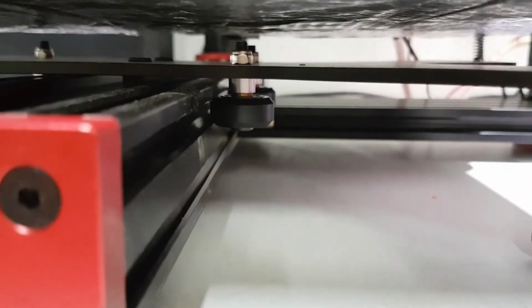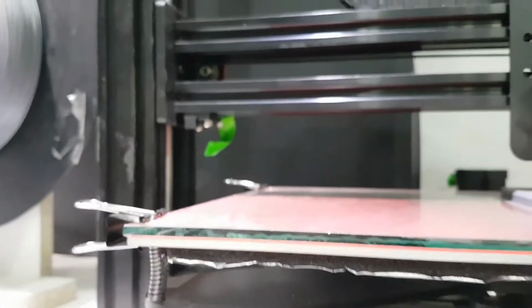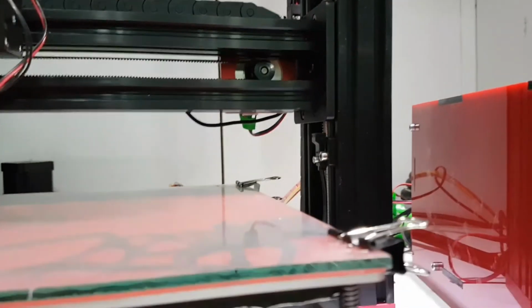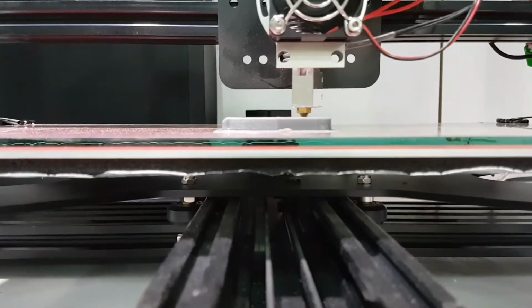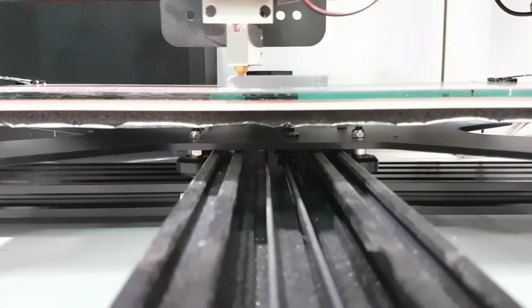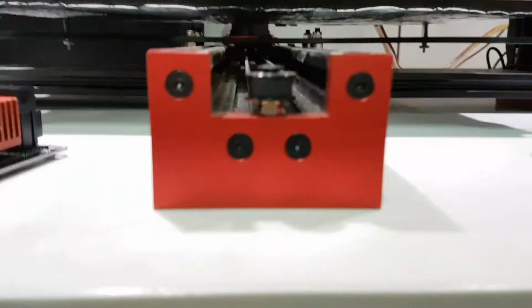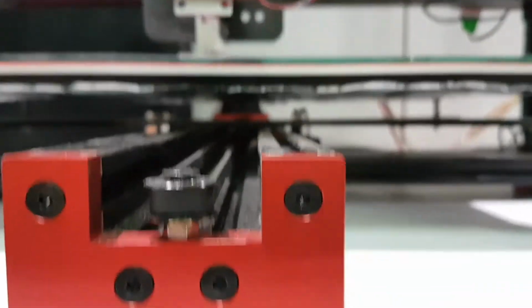What else is there? Oh yes, the Z-axis is actually driven by one motor, and they're connected via a belt from one end to the other. So you can really level this machine mechanically, so it is properly leveled across that span, and you can be confident of a nice square build because it is so nicely squarely made, and it's very precisely made, and all the corner components are not plastic, they are metal, and they're nicely machined. Let's just have a look at this front one for argument's sake, they're kind of pretty with the red anodizing and so forth, so they've done a nice job cosmetically.